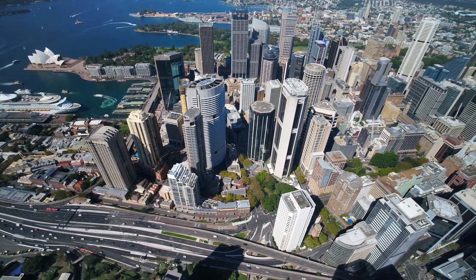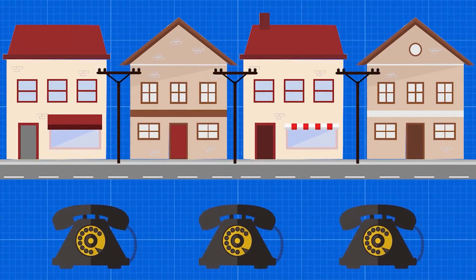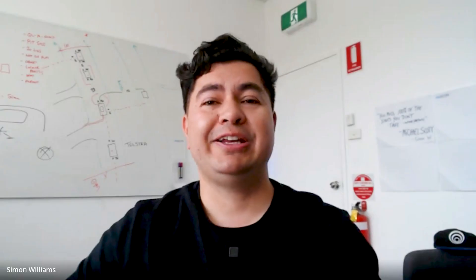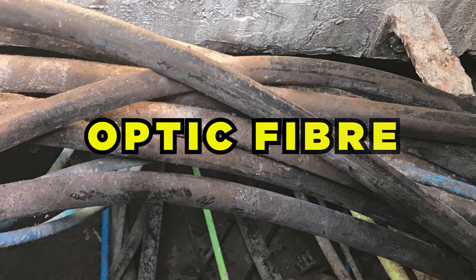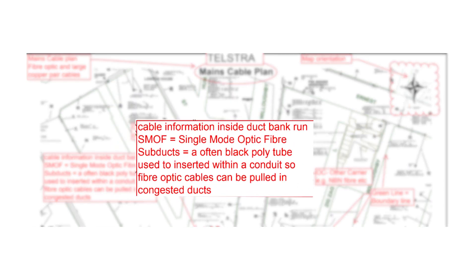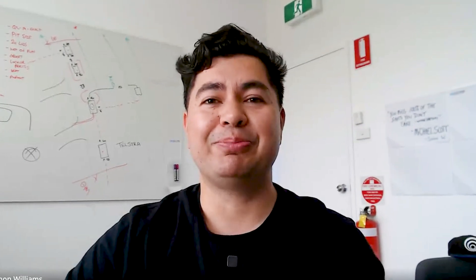One tricky thing is the plans also show underground cables as well as overhead wires. You may have noticed in Sydney that there are telegraph poles which connect telephone wires straight from the pole to the eaves of the house. What you really need to know and be careful about when excavating on site is optic fiber. You'll see this in text on the mains cable plan — 'OF' is short for single mode optic fiber. Anything marked OF on the plan, be very careful and dig with caution.